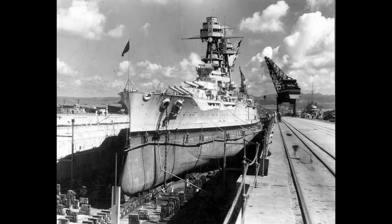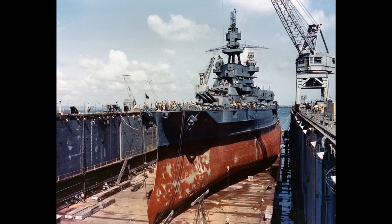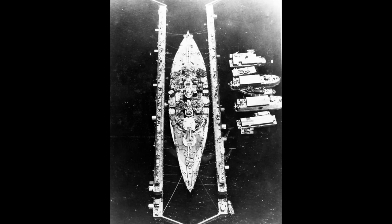Once the ship is stabilized, the next thing to do — especially in World War II — is actually check for refit or upgrade potential, because that will dictate actions going forward. That may be upgrades in the form of removing secondary batteries to install dual-purpose batteries, removing existing fire control and radar to install more modern ones, or flat-out installing new stuff — more 20mm Oerlikons, or adding radar where there was none. In some cases, like HMS Belfast, that involved bulges and additional armor. You need to check what, if anything, is wanted to upgrade the vessel, not just return it to its original state.